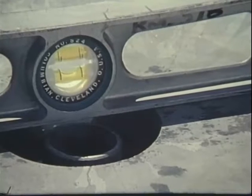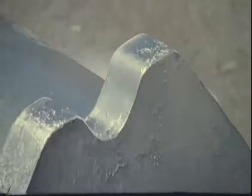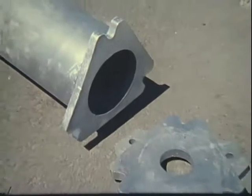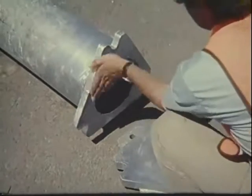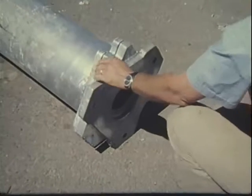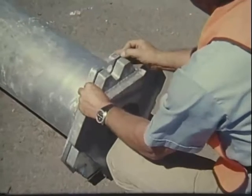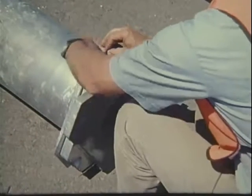After inspecting the slip base parts, the slip base can be assembled. Install the slip base onto the bottom of the pole while the pole is still on the ground so that the clamping bolts can be torqued evenly. All parts must be installed as shown on the California Department of Transportation standard plans. The slip base clamping bolts are placed so that when the pole is set in place, the clamping bolt heads will be underneath and the nuts will be on top. The keeper plate and hardened round flat washers are sandwiched between the two slip base plates.